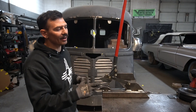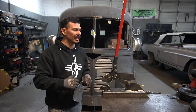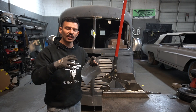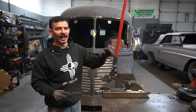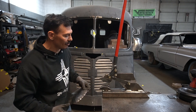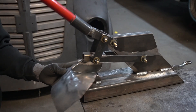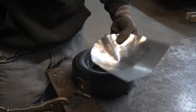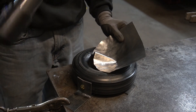Another cool aspect about using the tire rather than the sandbag is when you physically put a tuck in the sheet metal for shrinking, that absence of space or that void within the tire helps hold that tuck in place as you're hammering it out. I'll show you here on this tucking tool that I just built — the plans and builder kits are going to be available on my website at beametalfabricator.com. Let's go ahead and put a tuck and then hammer this out in the tire. I built this little base for it real quick just to hold the tire in place.